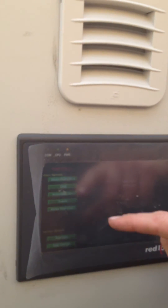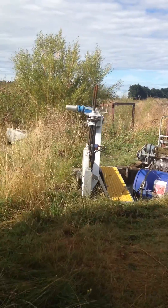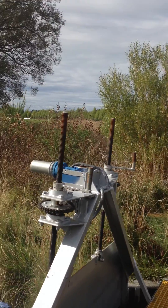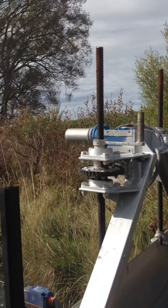When we dig a bit deeper down, we can have a look at the gate. We can set different limits. We can see here that the water flow is 887 litres a second, and the water flow is on a manual entry at the moment set on 900 litres a second. So what we'll do is we'll change this to 500. So it's now closing the gate. We work in 15-second increments because the water needs to catch up when it gets to the water level sensor.